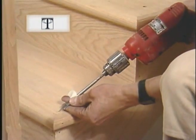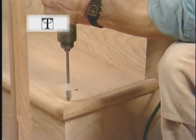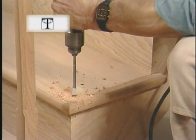I'm using a half-inch bit to drill out the dowel holes, and I've stuck on a piece of tape as a depth gauge. The dowels are birch — one inch is inserted into a hole in the end of the baluster and one inch into the tread.